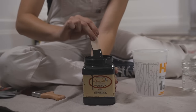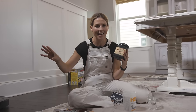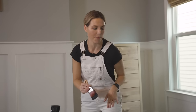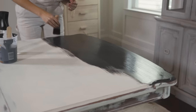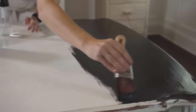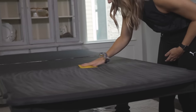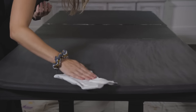The paint I'm using today is a chalk mineral paint, specifically designed to go on furniture — you don't want to just grab any latex paint from your garage. When I'm doing tabletops like this, I like to go from the shortest distance side to side, since my paint will dry pretty quickly and I want to keep a wet edge as best I can. I'm going to keep all the brush strokes going in the same direction. When painting with a brush you are going to have brush strokes, so I grab the super fine yellow rad pad and go back and forth against the grain of the way I painted to smooth it out a little bit.